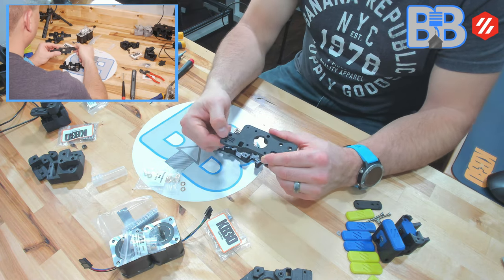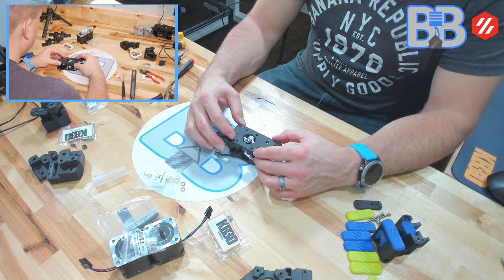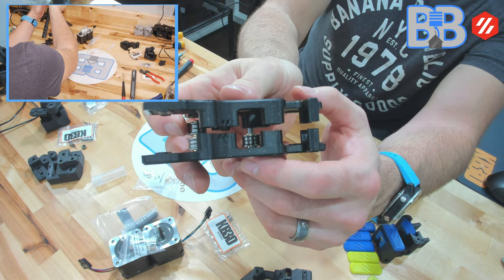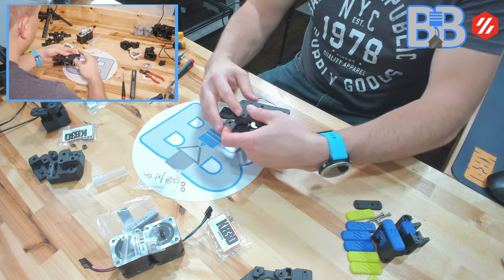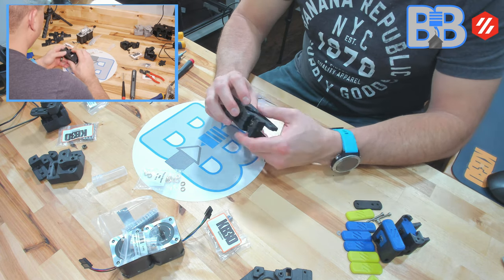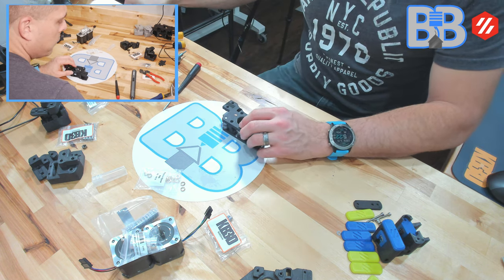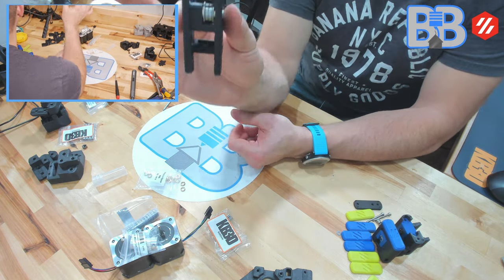Next step is to put the top piece on. On the pin-mod version we have extra pins sticking out on the top side for the attachment points to the extrusions. Line these up where the holes are for the pins, and be aware of the divot and male-female alignment feature on the plastic pieces — those hold each other together too, so not only do the pins align you, but the printed parts align each other as well.